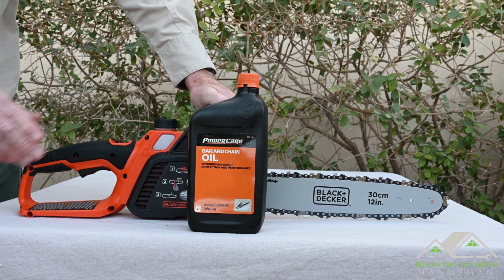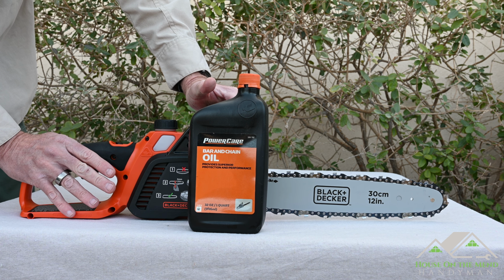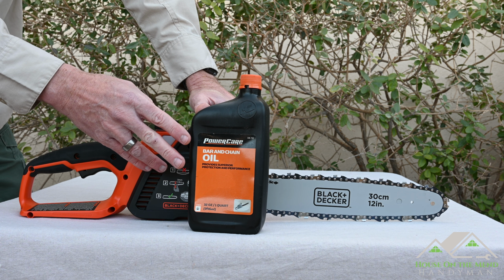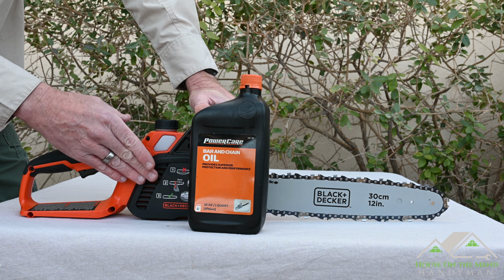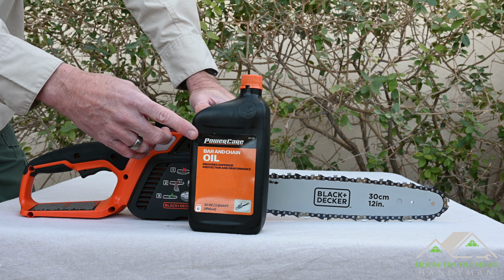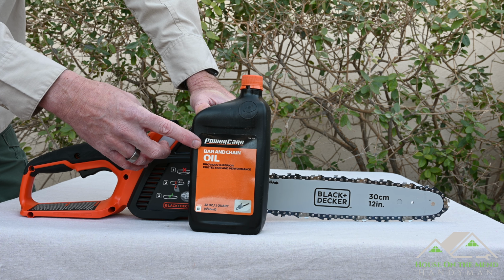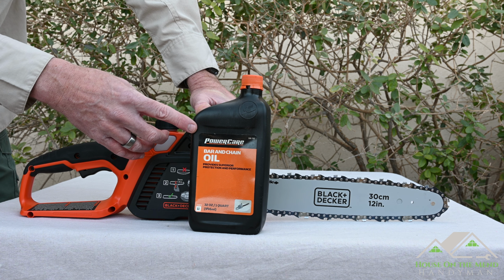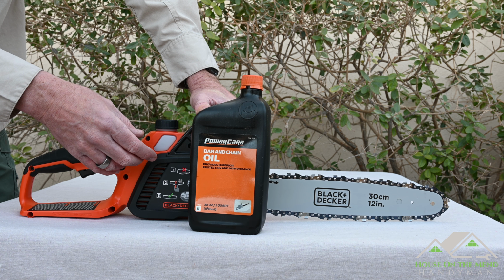All right, let's talk about bar chain oil. The unit I got did not come with any bar chain oil at all. Let us know in the comments if you got a unit that wasn't refurbished, if perhaps it does come with bar chain oil, but any bar chain oil will do. Let's talk about some of the ingredients though. I was reading in the manual and it recommended that if you're trimming a living tree branch, say you're pruning a living tree, they recommend that you purchase a vegetable oil based bar chain oil because that way it won't injure the living tree. They say not to use a mineral oil based lubricant for living trees. It could damage that wound that you create when you prune the branch off. So I thought that was interesting and wanted to share that. For any other purposes, any bar chain oil will do. I'll leave a link to a couple that I like.